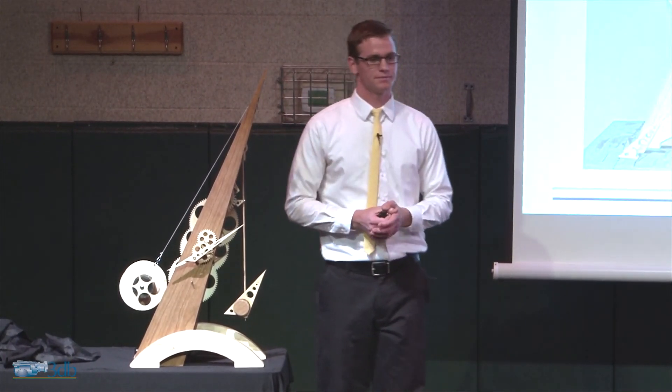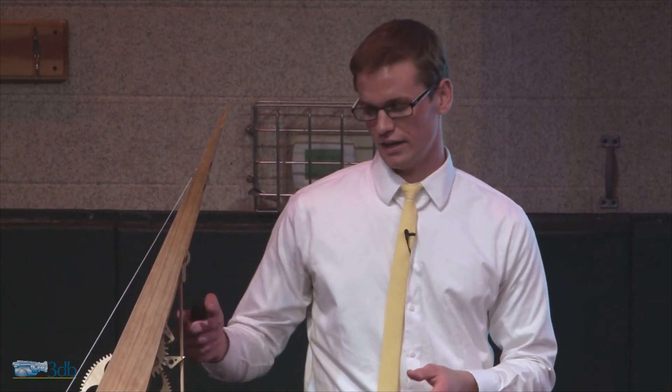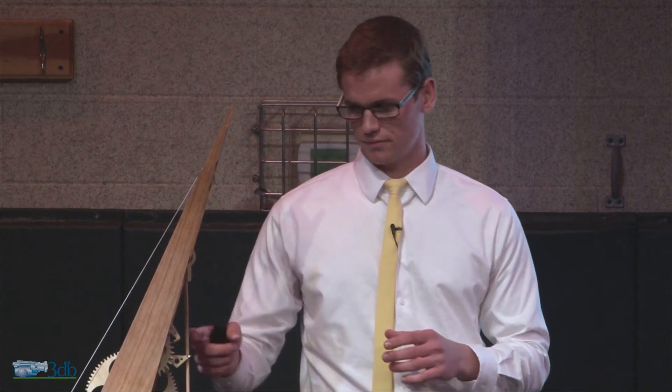The question is: when it didn't work, what was my first step? So when it first didn't work, I was rather down. I didn't really know what to do. But after talking with Rick, we found that the gears were not perfectly symmetrical all the way around. So I made them perfectly round and sanded all the teeth to make them very, very smooth.